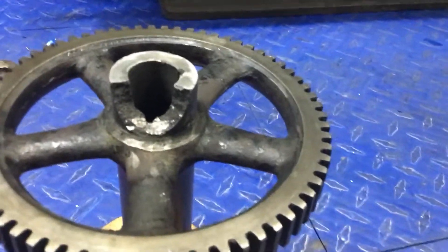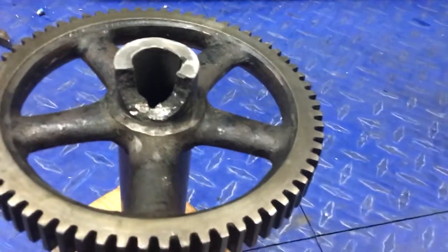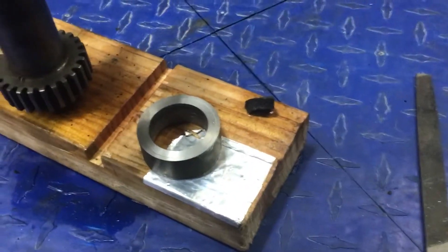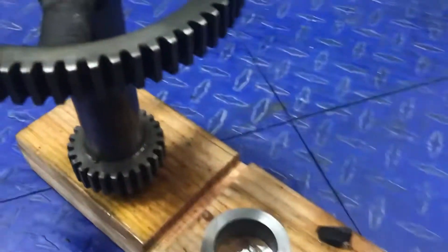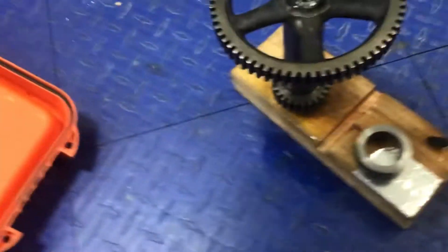There's no stress on this piece at all. However, it's ugly and it's stupid that somebody would try to take apart a lathe back-gearing this way — by banging the shaft. I used alcohol to wash it all and get the oil out, then roughed it up a bit before using the glue.